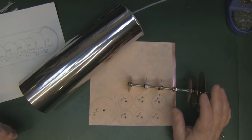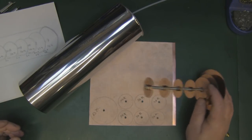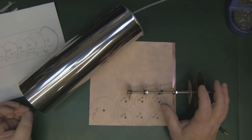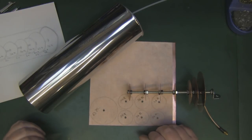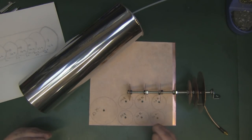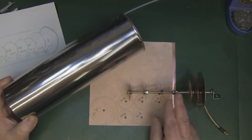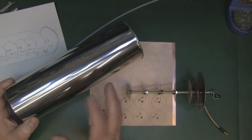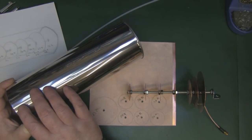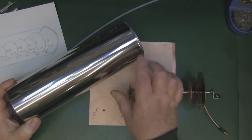This kind of design has been around for quite some time. If you Google it, you'll find people have used washers as the elements with a piece of threaded bar, inserted into Pringles cans, getting quite good results. In that setup, there's a main driven element — typically a dipole antenna inside the Pringles can — and the parasitic elements hang freely in the space inside the can, acting as passive elements that help focus the radio waves into the main driven element without being directly connected.